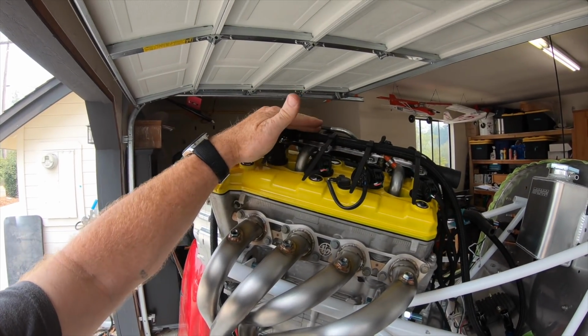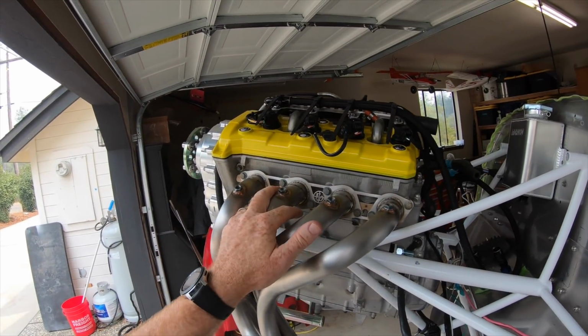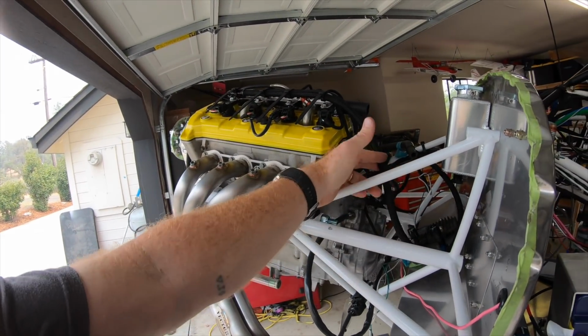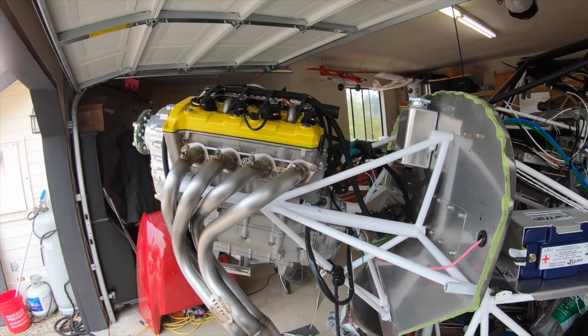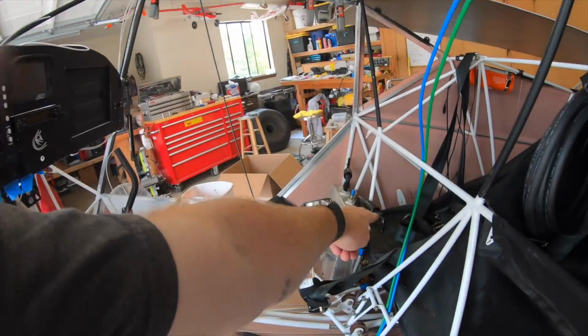And then I do need to undo all these and put a fire sleeve on that fuel line, just to keep it aviation quality. We're gonna do everything in firewall forward. We'll have the fire sleeve on it and be fireproof. So I gotta get that going, and the fuel line up to the wing tanks can go ahead and go in. I'll route that. It's gonna come across.